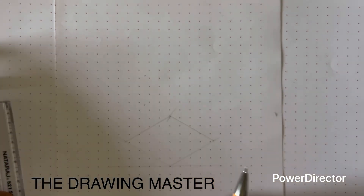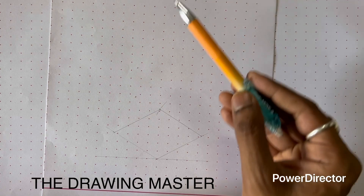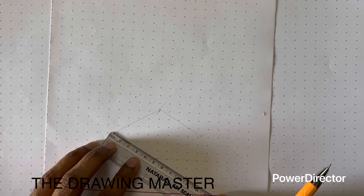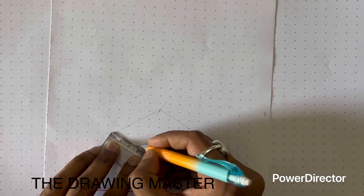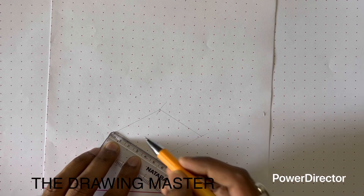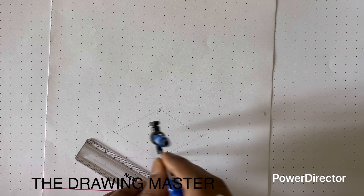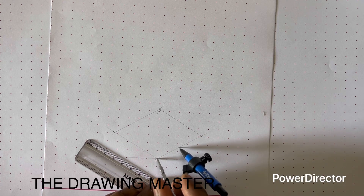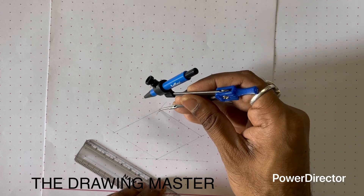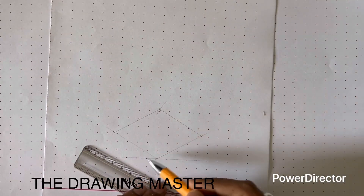Now we will find the midpoint of the lines. The base of the object is ready; now we have to construct the height. The height is 60, so we will take the height from the center. Let's mark the centroid of the object. This side is 50, so half the dimension is 25mm — 0, 10, 20, and 25mm. With the compass set to 25mm, mark 25 on this side and 25 on this side. Similarly from here, 25 on this side and 25 on the other side. We have now marked the midpoints of all four base edges.